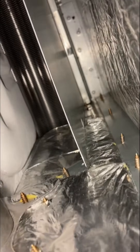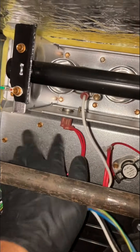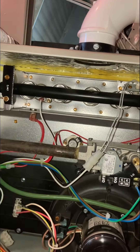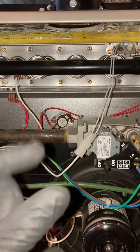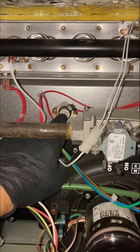The problem is the insulation surrounding the high limit is actually glued onto the surface. You can see the shiny foil material — behind it is fiberglass — and it's just glued on with some kind of epoxy or hot glue. The glue around the high limit switch tends to come off, and the insulation backs away and insulates the switch. So instead of measuring air temperature passing across it, it gets insulated and now measures radiant heat from the heat exchangers, which are much hotter than the airflow. So these trip prematurely because they're measuring radiant heat, not air temperature.